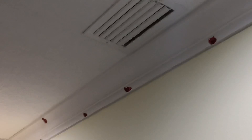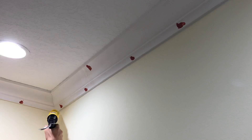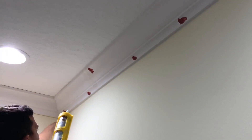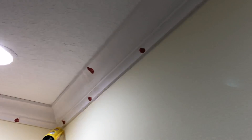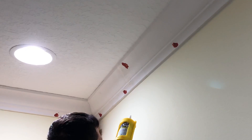A lot of people are using caulking to fill in the brad holes, and it's not the right thing to do. If you purchase Bondo glazing putty, you will get two different parts that have to be mixed together to form a permanent, very solid filler in the nail holes. Otherwise, you're going to see each of the nail holes with the shrinking caulking after you paint it. This is the best way to fill in the nail holes on any of your trim.